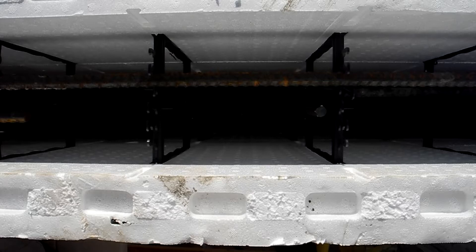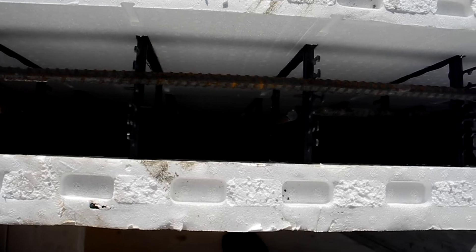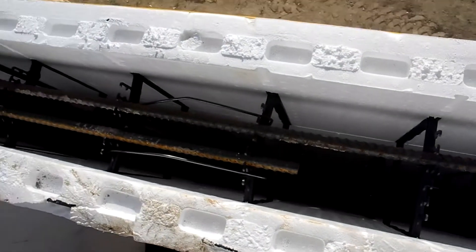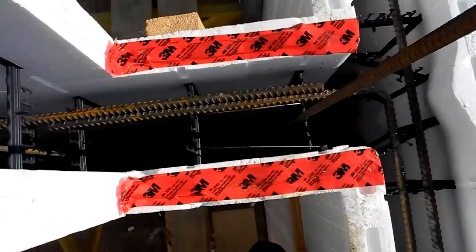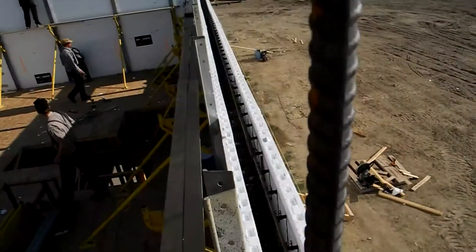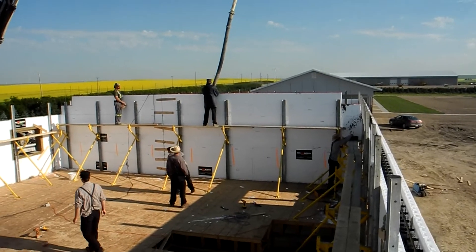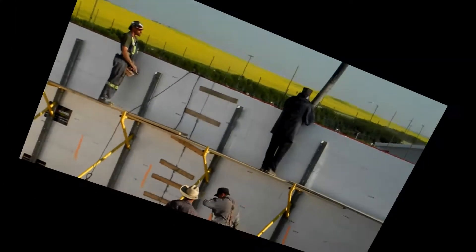Looking in the wall, you'll see that they have all the rebar done quite well. That's a 15M or number 5 bar, and a 10M or number 4 bar for the vertical — very nice job. Running into the T-block here, again they've done a nice job with the 90s getting that all done up. They've gone a little bit higher with the demising walls because that has to go up through the roof for fire separation.